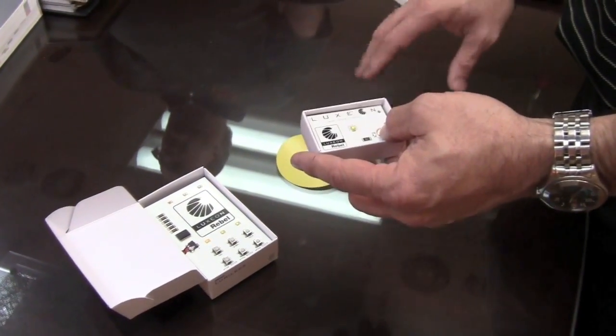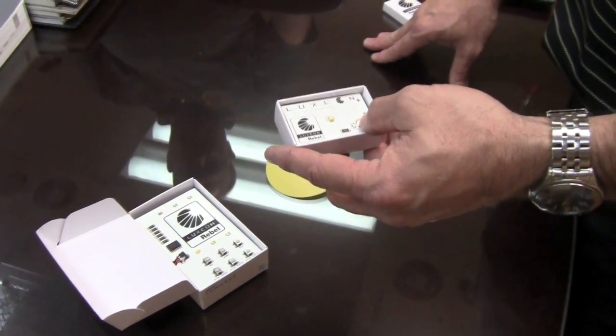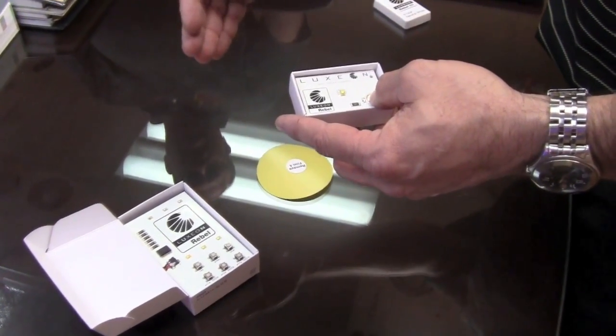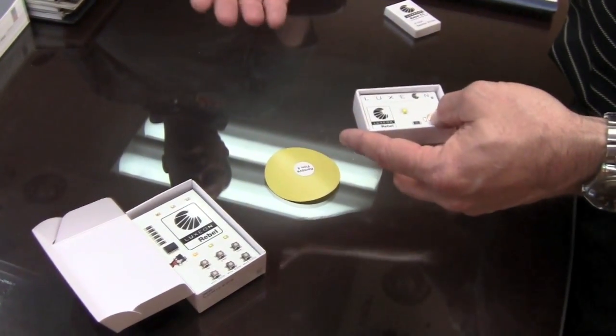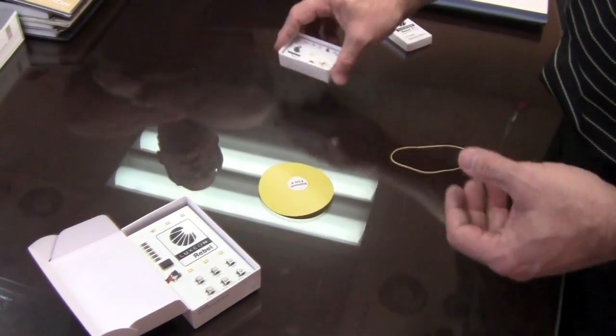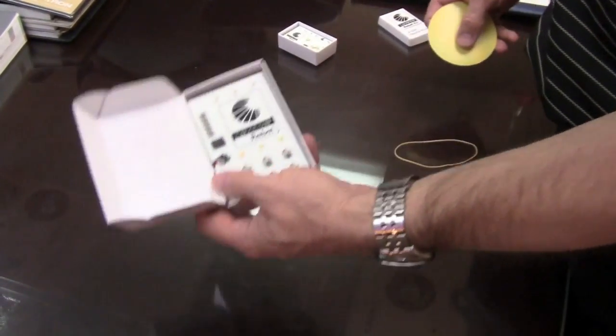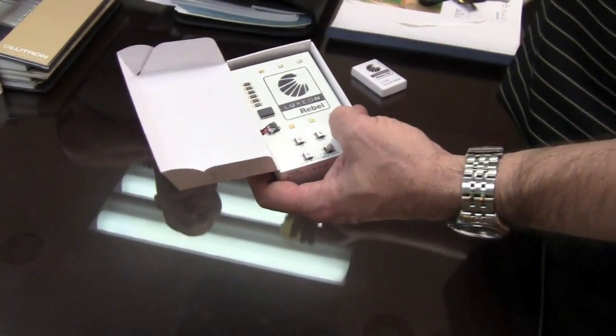By putting phosphor directly on the LED, it causes it to run a little bit hotter. The warmer the color, in other words, if you want something more of an incandescent color, it takes more phosphor. So you can also get a little bit less light, and it causes the LED to run a little bit warmer. So it would last less. Last less, or you have to cool it off. You have to increase the current. You've got the fins, exactly right.